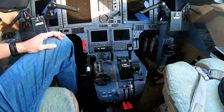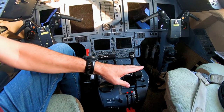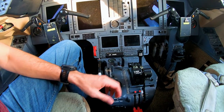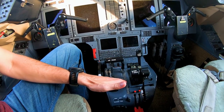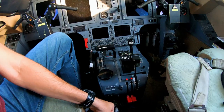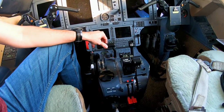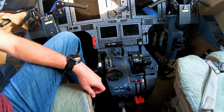It's actually pretty critical to the landing of this airplane. Right down here you can see this lever that says 'air brakes' — it's pretty big, right next to the throttle levers. Right after landing you'll see us bring the throttles all the way to idle, then take this lever, bring it all the way back, lift it up, and then down. Once we do that, that's what activates the lift dump system.